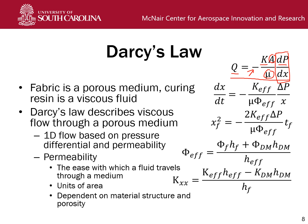Once we divide out the area term, that gives us a linearized flow rate here, and we've also kind of split off from the area this porosity. It's kind of a normalized term. And we just have a finite distance x and a finite pressure differential here, indicated by the delta instead of an infinitesimally small pressure differential as indicated by the previous letter D. So these effective quantities are what we'll be measuring, its effective permeability.